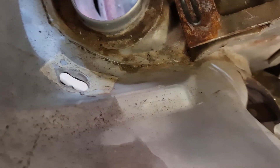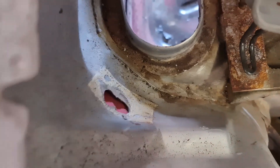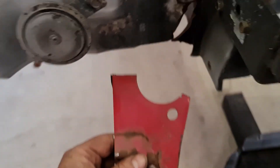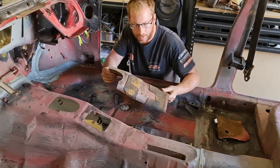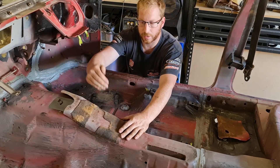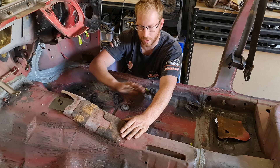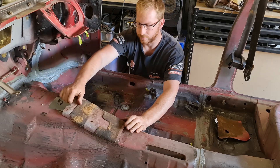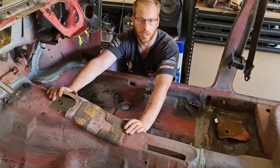This little piece is for the corner in here — that'll fill that one in. And this piece is at the front here, so I'll clean that up so it goes in there. Now I've got this cut out, I'm going to draw the rectangle shape and then sit it on there and cut it at a 45-degree angle so this top bit will sit flat and perfectly into this section. I've seen it done on other YouTube channels and I'm going to do the same, so I'll mark it out now.